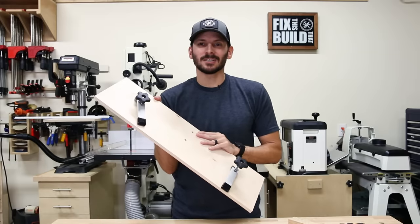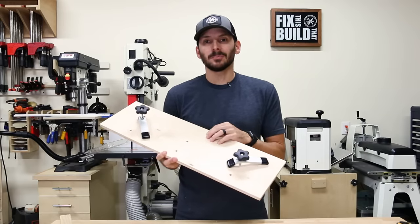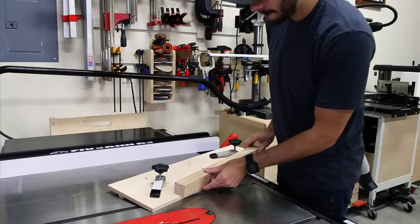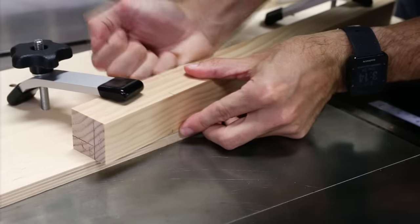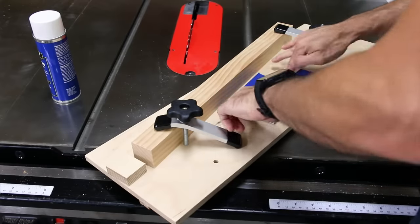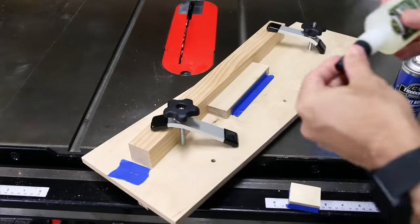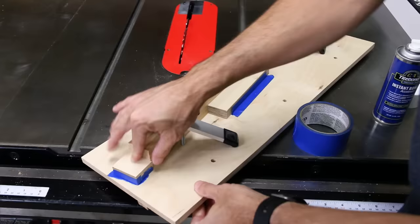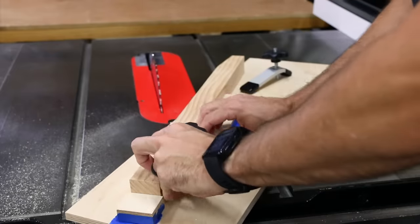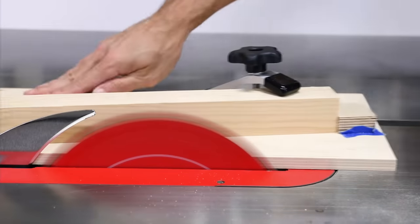In just about 10 or 15 minutes you can put this all together. This is great for one-off cuts, but if you want to make repeatable cuts, use CA glue and painters tape along with some little clamping blocks. Start off by clamping down the first part to be cut based on your layout lines, then put in some positioning blocks to make it repeatable. Use a piece of tape on the sled and then a stop block with a straight edge, put another piece of tape on that, and use CA glue on one surface and activator on the other to lock them in place. Add a small block on the back using the same method and now you've got reference blocks. This process is fast — it'd probably take 20 or 30 different positionings before you'd invest the extra time to make the next jig. When it lacks easy adjustment it makes up for it in speed to make and the limited tools required.